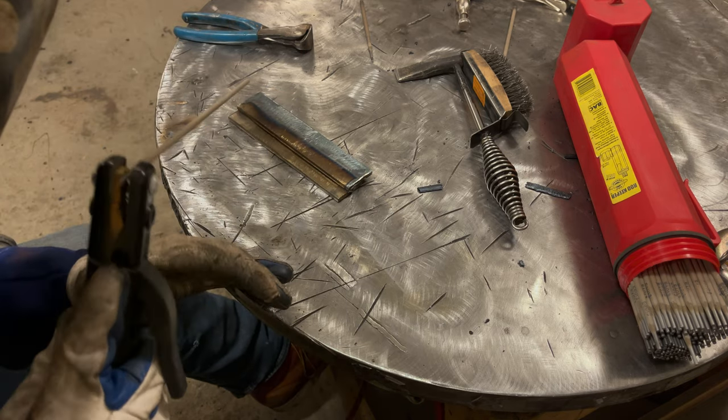Say you did a, I don't know, a 9-pass weld, right? If every start and stop is in a line, the probability of a crack starting there is a lot higher, simply because if the whole line of welds has porosity at your restart, where's the failure going to start? Obviously in line right there. So by staggering it, any little bit of porosity or lack of fusion won't be as serious of an issue.